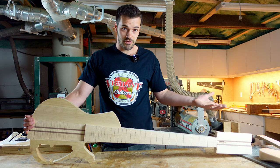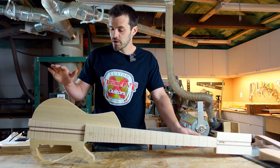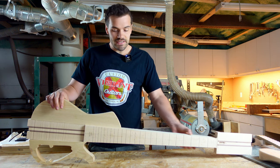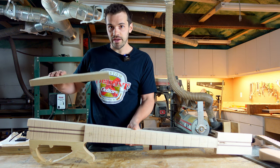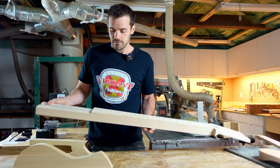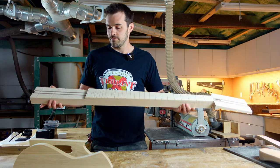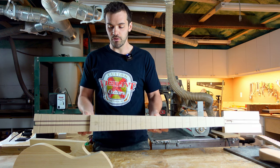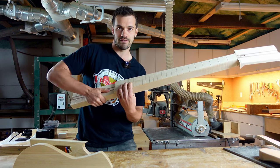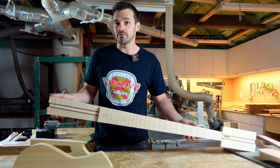The added durability is great, but on the finishing and construction side it's a lot more complicated. The model I have in front of me is our Heron bass — this is one of our neck-through models, and it only comes as a neck-through. It has multi-laminate beams running all the way through the neck, with two wings glued to the sides. The multi-laminate beams run from the body to the tip of the headstock, giving it its strength, and allow me to fully sculpt the neck profile all the way up to the lower horn, giving players full access up to the 24th fret — where bolt-on or set-neck models would have limitations.